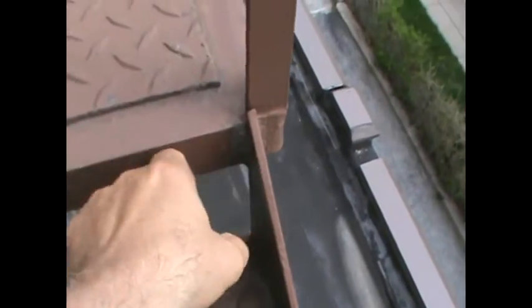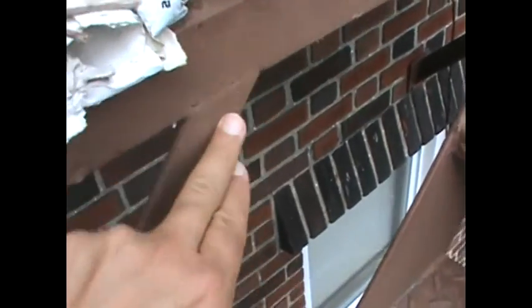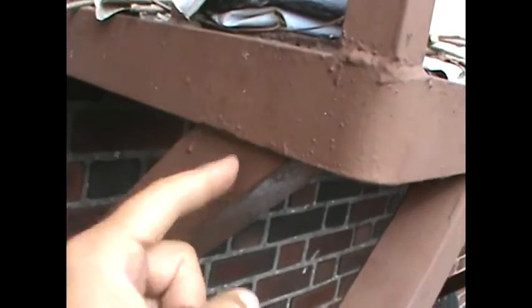I put a little clip here, bolt, eliminate that weld. Put a clip underneath these treads and put bolts, and I don't have to verify these welds through x-ray or load test. I put a plate here, bolt, no need to verify that connection. Put a plate here, bolt, no load test. Put a bolt through here because it's welded, no load test. Silicone shut all my connections.